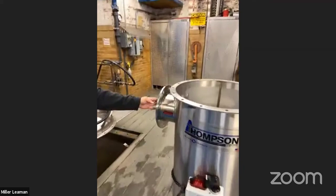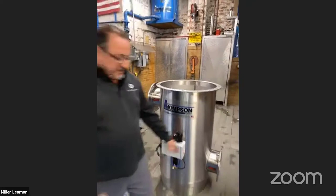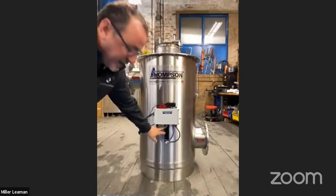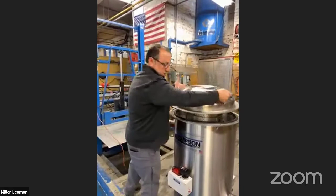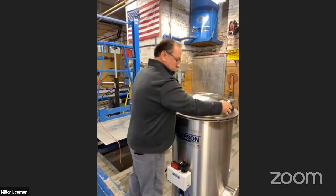Inside, there's a riser and a pipe that comes up — available in stainless steel as an option, or our standard PVC 90 riser that comes up into the screen. The screen itself fits right in. We provide handles for you; it goes right into the housing and comes right down — that's how it sits. You have your dirty water side, and all units come with an air relief port — just a quarter inch air relief port where you can put a little valve.